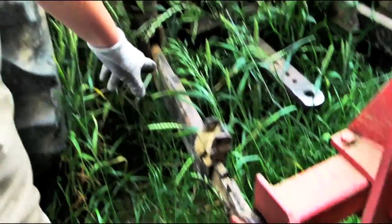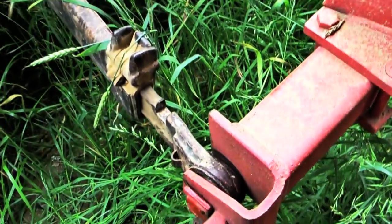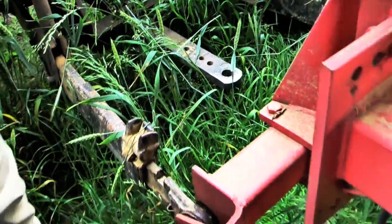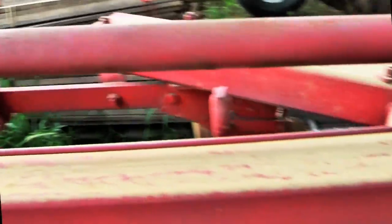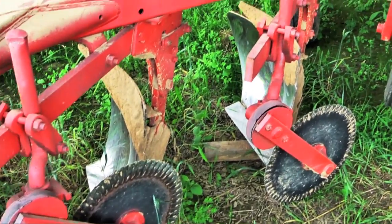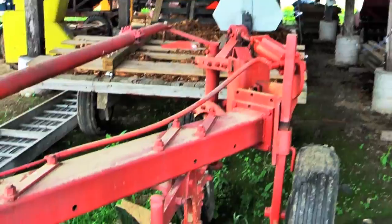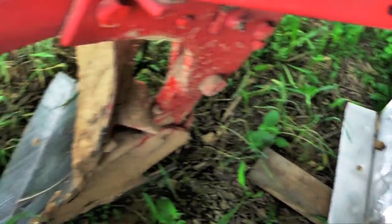These pull-outs on the lift arms make hitching up mounted implements a lot easier. I can slide that out and get hitched, then fire the tractor up and back up and it'll just click. This is a semi-mounted plow. There's a tail wheel back there and that's what this hose manipulates — kind of like one of those fire engines that has a driver in the front and a driver in the back.